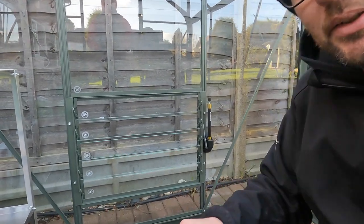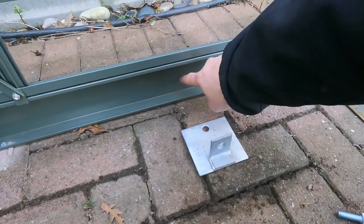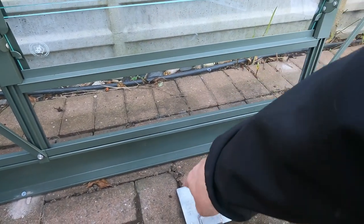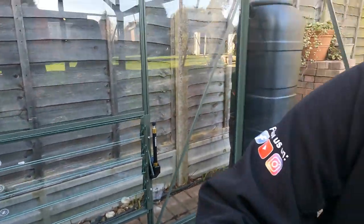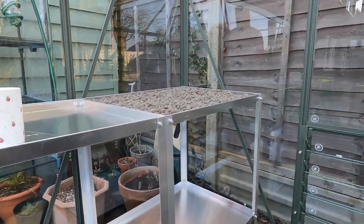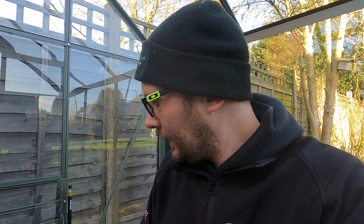The important thing now is actually getting the cable in. What we're going to have to do is drill through here, bring the armoured through, then up the back or around the front and into the unistrut. I've got another couple of jobs to do inside, so I'm going to get Jack to fish out the armoured cable from behind there and start running it along. We'll get cracking on drilling the holes. I'll show you the board inside as well.